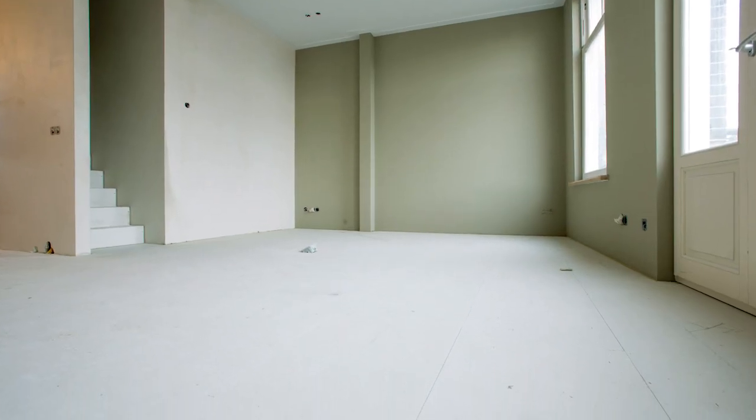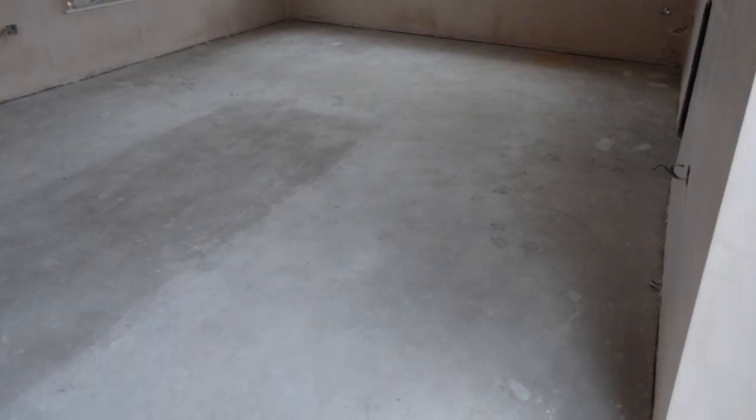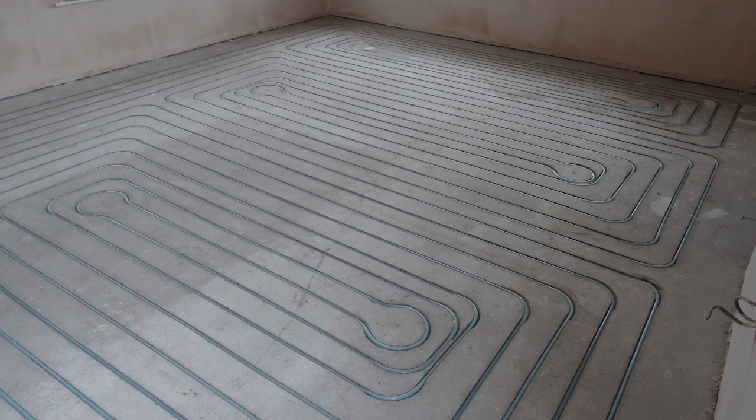There are certain things which will aid the efficiency of the system, decent levels of insulation, double glazing, that type of thing. Houses built prior to 1995 won't tend to have any insulation in the floor. It's not a problem as far as the underfloor heating system is concerned. As a retrofit system, all of the design is put into allowing for the small amount of heat loss. In an ideal world, with any underfloor heating system, you would have insulation in the floor. However, the benefits of using the JK system, for example, where you're not having to dig up the existing floor, by using the 14mm pipe, which is close to the surface, heat transfer is very, very good. In normal circumstances, it's sufficient and no insulation is necessary.